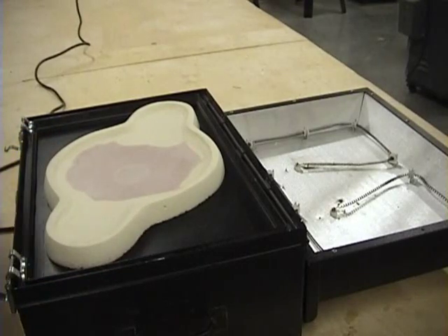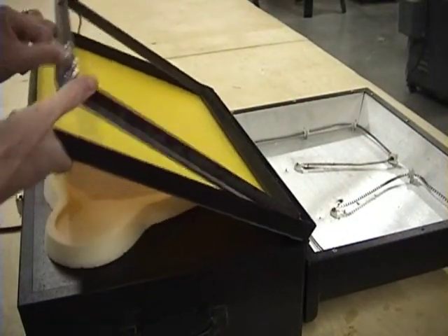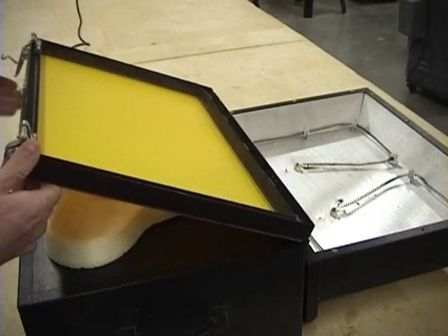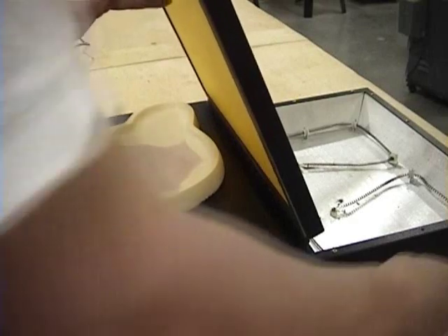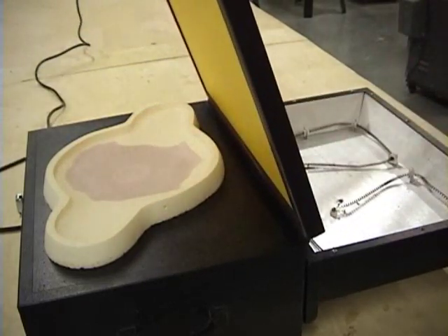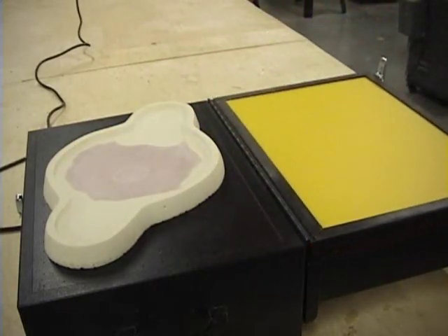Then we have the plastic, and this frame separates. You put the plastic in there, lift it up, slide it in, center it in the frame, and close it up. It locks in place, and there's another lock on the other side. We flip it over — but right before we flip it over, I flip the switch, which turns on the heating element. If we wait a little bit, you'd actually be able to see the heating element turn bright red because it gets pretty hot. I'll go ahead and swap it over — it'll take about a minute or so to heat up.